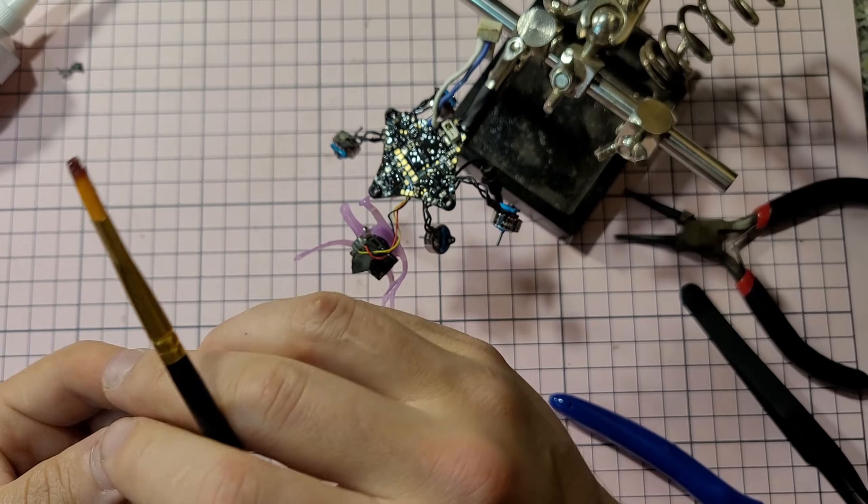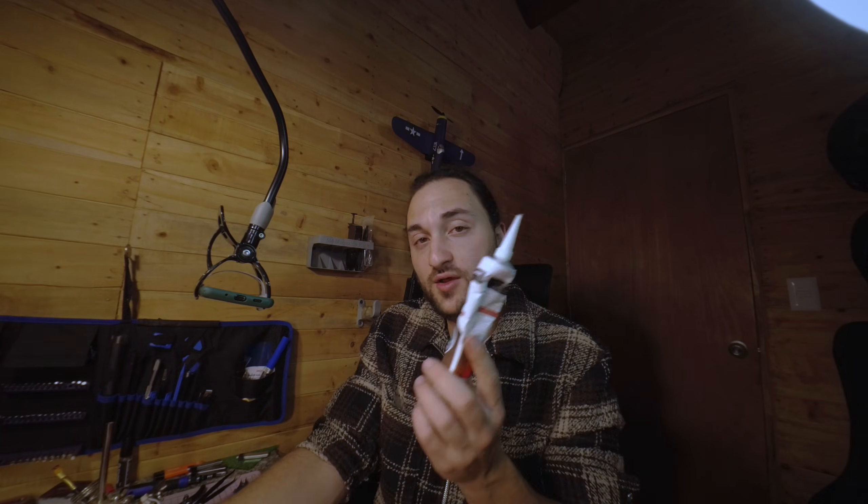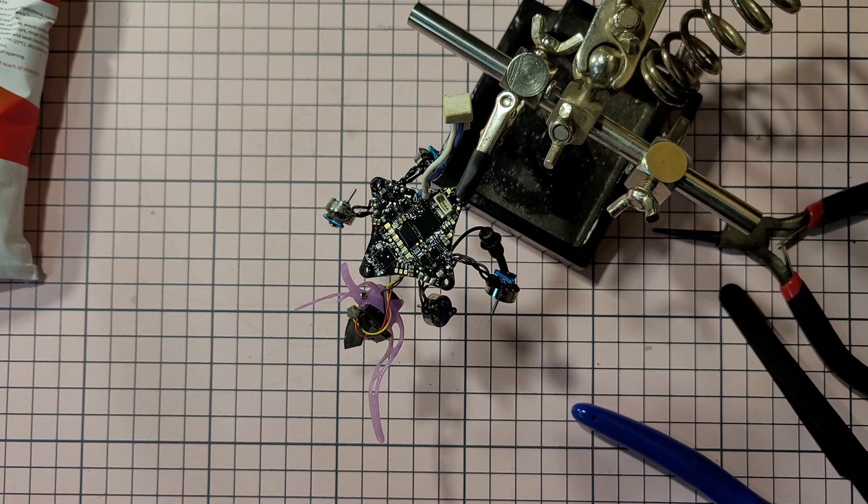Okay, so we coated the board, we coated the motor PCB, and we also covered the camera PCB. I guess the last thing that's missing would be — first — letting it dry. It supposedly dries in 15 minutes. I'm gonna let it dry, come back, do the UV light test, and see if it filled all the holes on the whole PCB. If not, I'm gonna apply it a bit more, but I hope I got everything on the board.